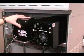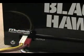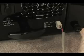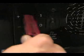First, place the Black Hawk power supply on the top shelf of the multi-link cabinet. This is the output circuit breaker, which trips when there is a fault on the output. This is the output connector, where you connect the output. The battery temperature compensation sensor plug is located below the fan. The battery connector and breaker are left of the fan.